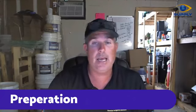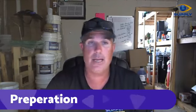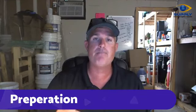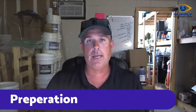I've done this in a one-day application: clean in the morning, go grab a little bit of lunch. I like to let it dry out. It depends on what your humidity looks like. But you can put this down onto a wet surface. Again, you don't want to put this down onto a flooded surface with tons of water all over the place, but you really want to let it dry out, though it doesn't have to be bone dry like when you're putting down a solvent base.